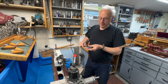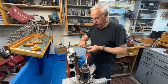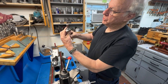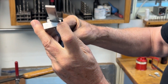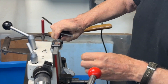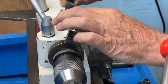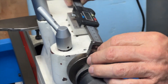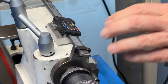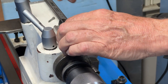That would make it much easier to install and work even better — less critical on where it's mounted. I'll also give you the angle of this block: it's exactly 22 degrees. If you start out with that and try it I think you'll be fine, because this can be milled a little bit off a few thousandths and it won't matter. If you start with 22 degrees I think you'll be right on — obviously if you have a different lathe it will be different.